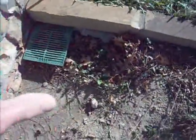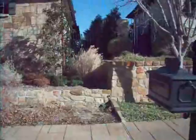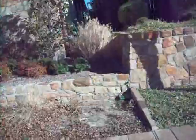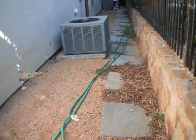This drain here intends to take water from there out to the curb. Well, there's a pipe passing out, but there's no outlet, which means it's not going to be very effective as a drain. So this area needs to be monitored when you live here. If you get a build-up of water in heavy rainstorms and it remains for a number of hours or such, you might like to consider having a French drain installed in this area, bringing water out to here. At the moment, my concern is it will build up and you get high water, hydrostatic pressure in the ground at the right elevation, which could affect the foundation.